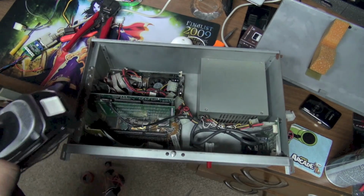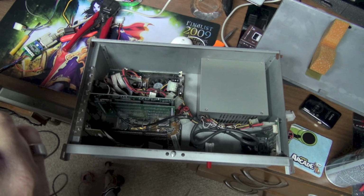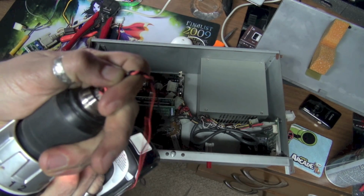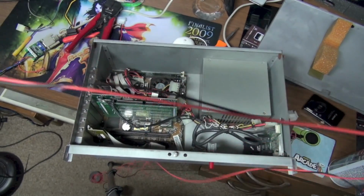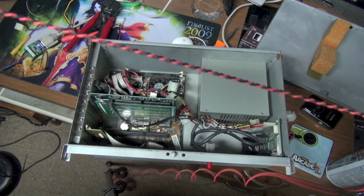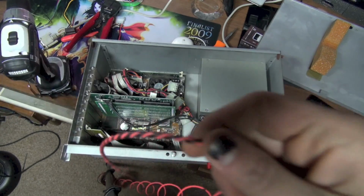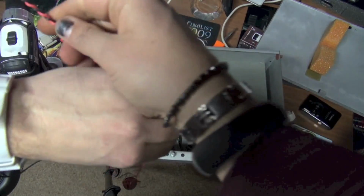Okay. What I want to do is put my wires in the chuck and tighten it down. And then basically, I'm going to take the wires here and let the drill do all the work. It's going to make a nice, very nice twisted pair that we're going to use to run our power from the cabinet. I actually want it to be a little bit longer. It came out of the chuck here, so let's try it again.